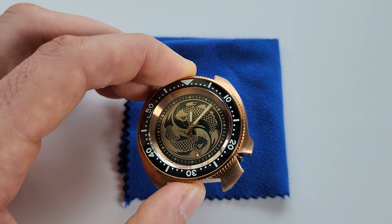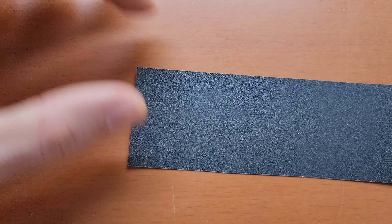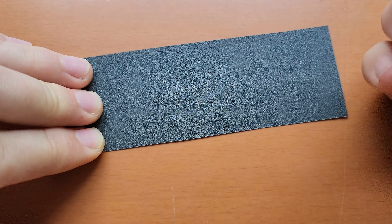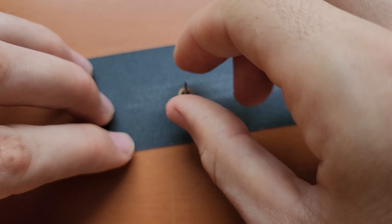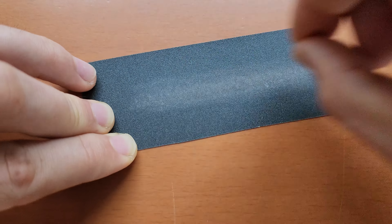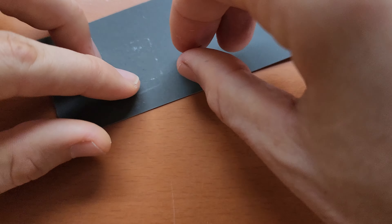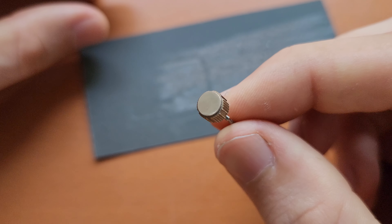Now do you want to see how I remove the logo from the crown? I'll show you. I use two kinds of sandpaper — one to remove the top layer with the logo itself, and another for polishing. You have to do it in one direction. You can see it's already coming off a little bit. Brass is a relatively soft metal so it's not hard to remove. There you go — now it's completely clean. I want to polish it — it's polished and it looks much better.